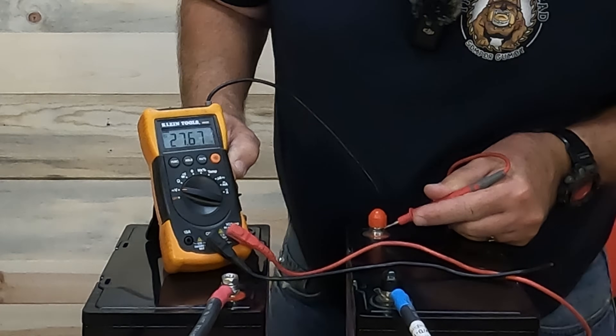We've talked about how to put these batteries in series and why you would do that. Now the question is: will they burn your house down, will you destroy the batteries? The answer is no and no. The batteries are fine. The manufacturer tells you you can put them in series. They've got battery management systems that provide a great deal of protection. And if you put an inline fuse — that's a good idea too — a 100-amp inline fuse between your connections would be a good safety measure.